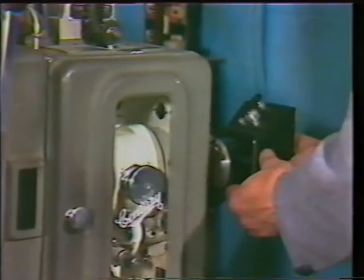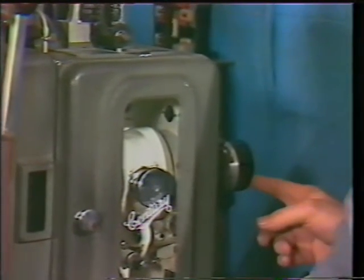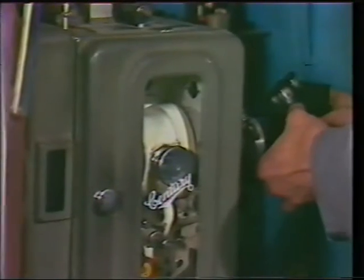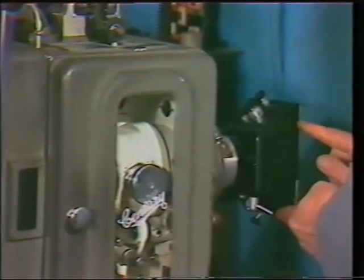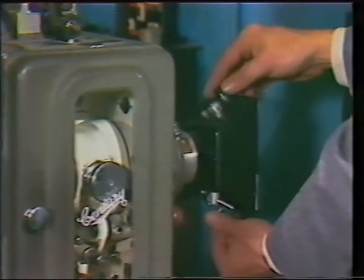The mirror box will now slip onto the adapter tube. Before we do that, let's take a look at the 3D picture without the mirror box. This is what the picture should look like without the mirror box — the line in the center of the screen is the septum, and framing is adjusted to place it in the exact center. Now the mirror box is mounted. The mirror box takes the upper image and brings it down; the lower image is brought up. These are easily adjusted with the separate adjustment screws. On an alignment film, the end result will look like this. Any horizontal error can be corrected by rotating the box slightly.